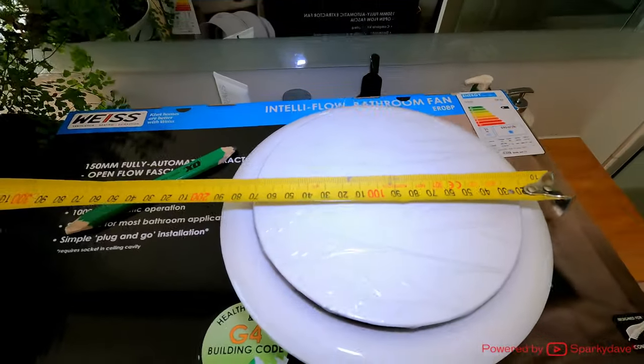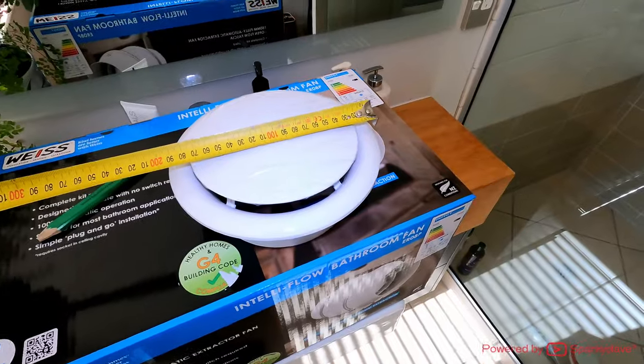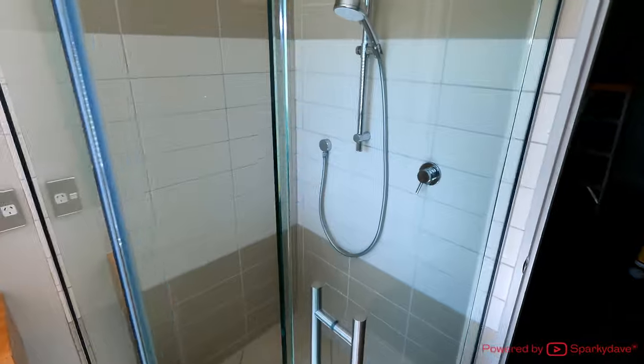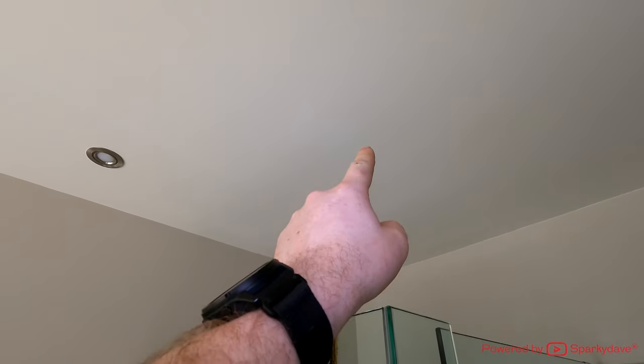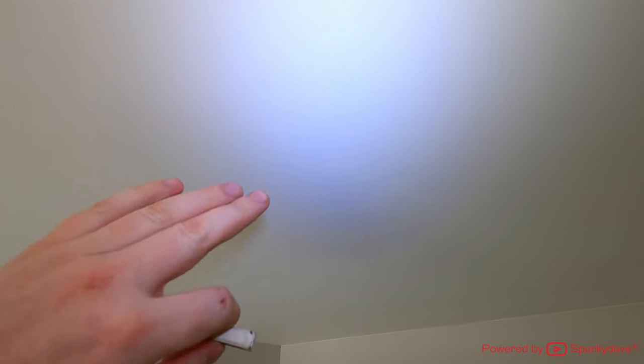The diameter of this fan is around 200mm, so we'll subtract 150mm to be safe off each side. 150mm off 990mm is roughly 840mm out. I'm going to put a mark on the ceiling at 840 by 840. I do it very faintly with pencil so I can always come back and rub it out later, especially if there's timber in the ceiling and I need to reposition the location of the grill. Done very lightly and carefully, it leaves no blemishes at all on the ceiling. So here I've marked out 840 by 840 - if you hear that hollow sound, it's a good noise because it means there's no timber in this vicinity.